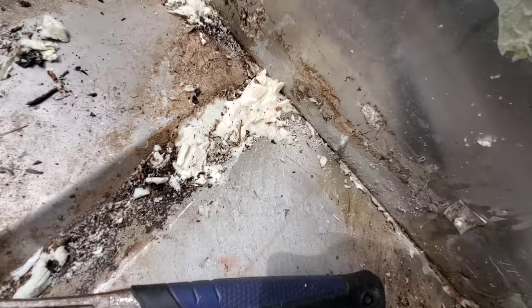I took my DeWalt sander and hit all the parts really quickly with 80 grit, just kind of knock everything down. I'm gonna go ahead and take the Bondo fiberglass resin and the hardener, mix them together, and I got some cheap brushes. I'm gonna apply a good coat on the top and the sides of all of the parts. I did a video on fiberglass resin. It is a full video on how you do this and how it works and how it actually waterproofs. The wood, I actually submerge it in water and leave it for 24 hours, and it just shows you that. So if you're interested in more on that, check the video out and the link up in the top.